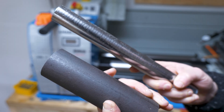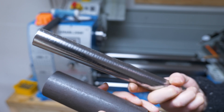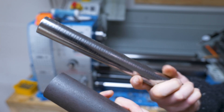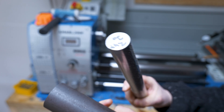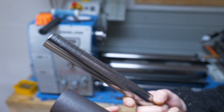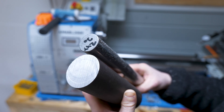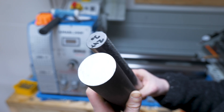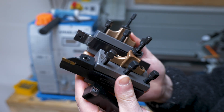We had to wait a few days, but I've picked up another bit of EN24T steel. It's a very nice finish — I'm guessing it's been previously machined. It's just another little offcut, and thankfully this is 30 millimetres in diameter, so I've only got 4 millimetres to take. There is a lot less stock to worry about, which is definitely a good thing. I guess it's a good excuse to pick up some carbide tooling.